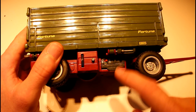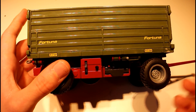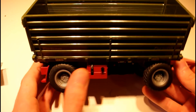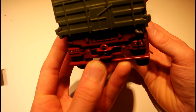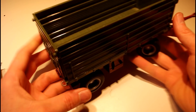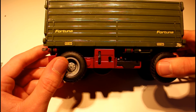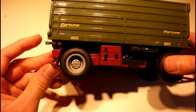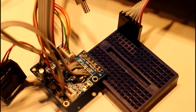To show what we're trying to achieve, I've put the battery in. This trailer has handy little buttons to manually control it without connecting to a tractor. There's a switch for up and down - you can see that raised the back of the trailer - and a button for the tail light and indicators. We're hoping to get control of the tail lights, indicators, and tipping, so we need to figure out those signals: one per indicator, one for brakes, and one to raise or lower the bed.